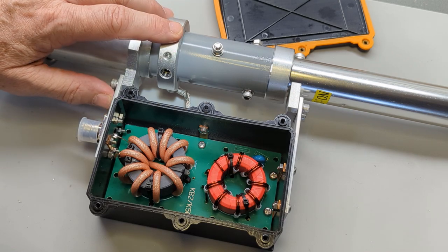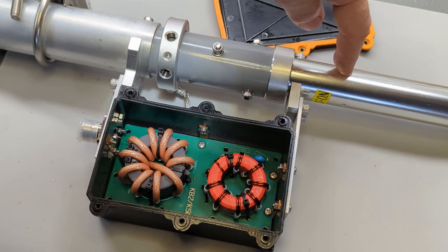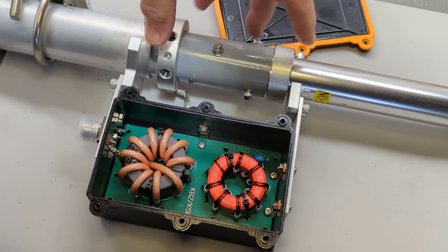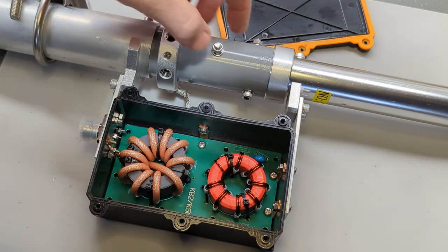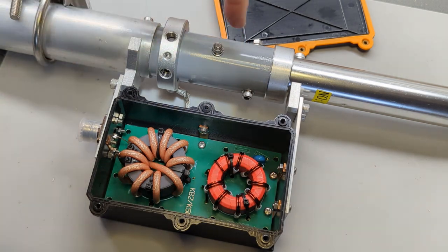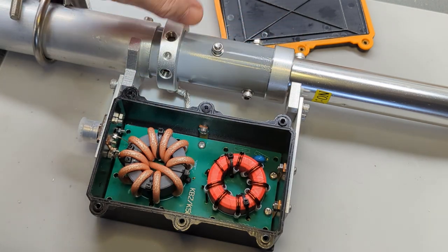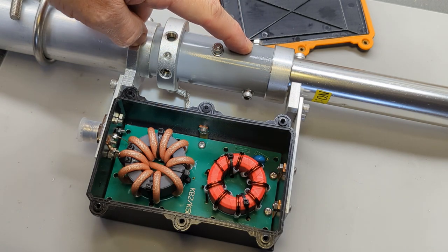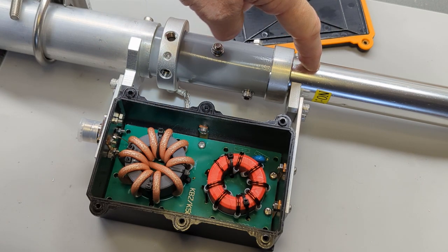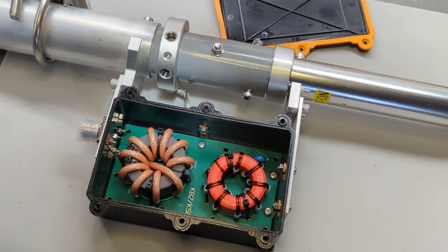And I think that's what happened here a little bit. This is a PVC tube - it's an insulator. This is what keeps the driven element from talking too much to the ground side, as it were. This is where the electrons don't travel. This is also where an awful lot of torque is applied during the actual bending. So this is a very important piece down here. And generally it's a pretty nice, robust unit, except that the interior diameter of this PVC pipe and the exterior diameter of the first element, which has to go inside, they were not the same. They were not compatible in any way, shape, or form.